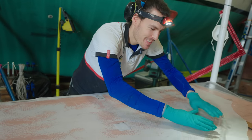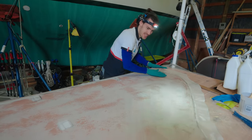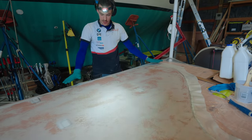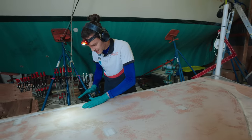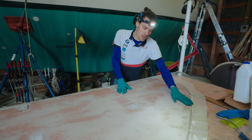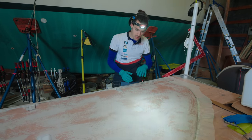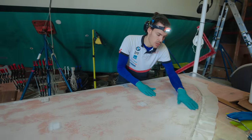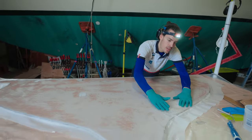Finally, everybody, has Magic Carpet used peel ply? No. We've used it here and there, yeah, but... Yeah, totally. We do rarely. People always get, not upset, but yeah. Almost. I don't use it often because the next day it is garbage. It really depends on the purpose. Here I'm using biaxial glass. I don't have that mat to sacrifice to fair things smooth. And since I'm using it on a very flat surface, but all the other surfaces always need sanding anyway. They need putty, so then I really don't bother.